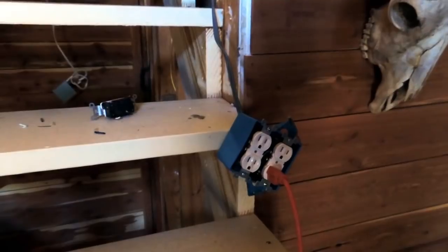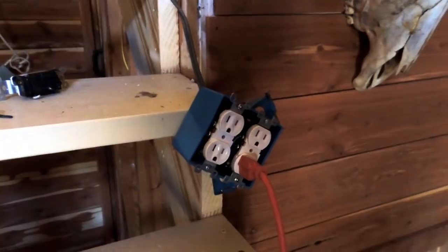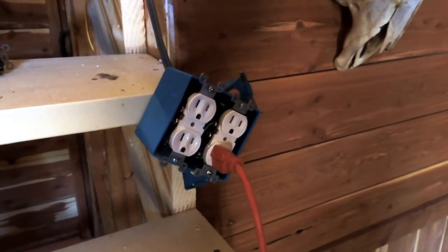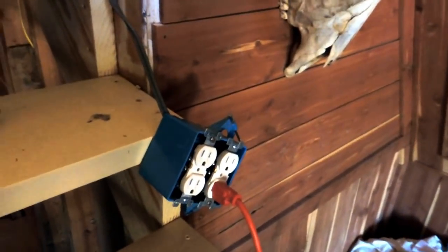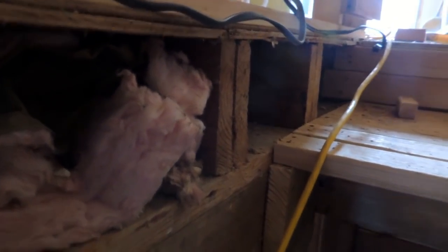I just did a little electrical work — I didn't have a single outlet box so I put a double in there and pulled the light switch out, so I only have one wire going there now and can tap into it later. It's not the most ideal place for it, but we'll let it hang there for now. I can't finish further down the wall until I get two new boards for the steps — I ran out, so we'll hold off on that section.